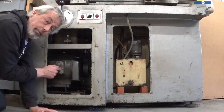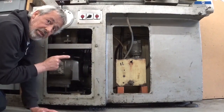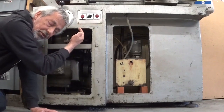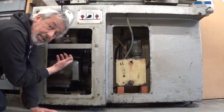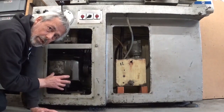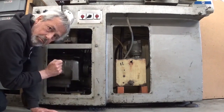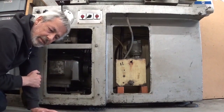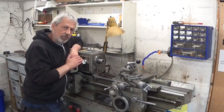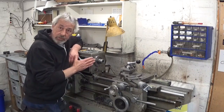This is the electric motor, and up here are two gearboxes. For me it's impossible to put my arm in here to go up and loosen the bolts. If I want to do that, I have to take at least the gearboxes out. But to take them out, I need to take the motor out, and then loosen the belts, because it's a belt-driven system. Then maybe I can tweak a bit, assemble again, give it a try, see that it doesn't work, and take it all apart again. Now you understand why I don't want to play around trying to fix this alignment problem with the headstock.